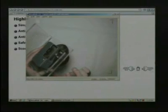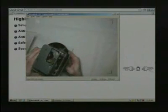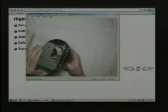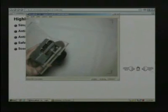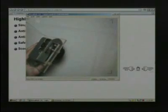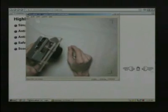What you're doing is you're basically feeling when the nose enters the gate, just ever so slightly. You can feel those two points on either side, and that gives you indications of how far down it's going. Since one wheel is a little bit higher than the other, the distance between those two points when the nose is allowed to come down a little further will be smaller, and you'll be able to feel that and map it out on a graph or just notes, as I was doing, and tell roughly where the gates are on the wheels.